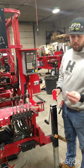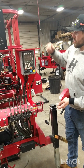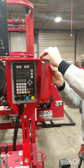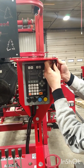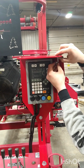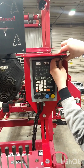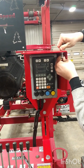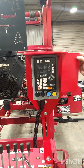To install the sun shield, we're going to go ahead and place the provided bolt through with a 5/16 flat washer, face it down, and we'll install a nylon washer underneath that in between the sun shield and the bracket. And then we'll install another flat washer. We're going to go ahead and install our spring. We're going to install another flat washer. And finally our nylock nut. And we'll tighten this till the sun shield has enough tension to move, but not freely.